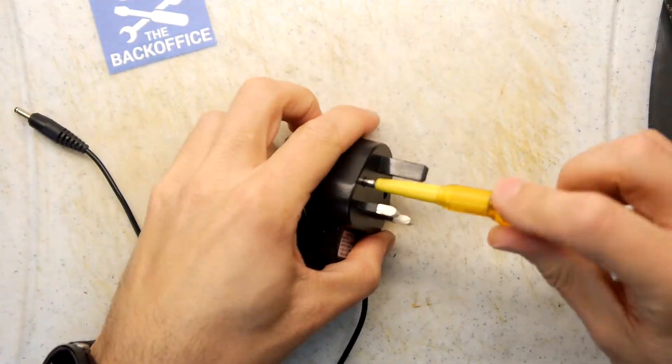There may well be a little bit of weird funk going on with that coil. So I probably could plug this in — let's get a multimeter on this bit though, see if there's something weird like a short or anything interesting to observe. We've actually got a dead short — you can hear the meter — between the outputs there.